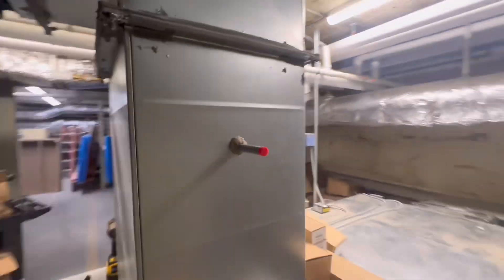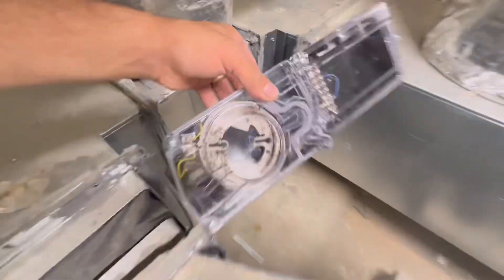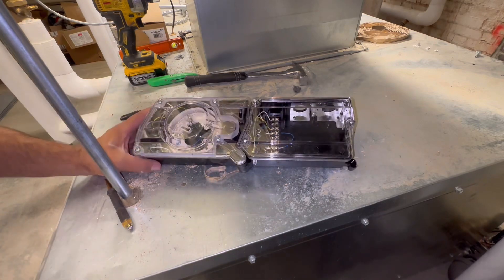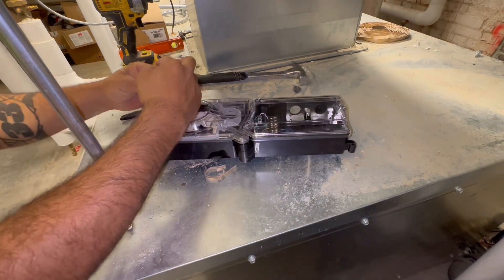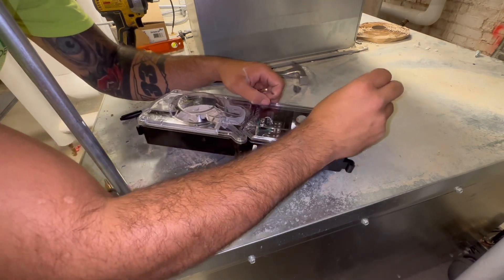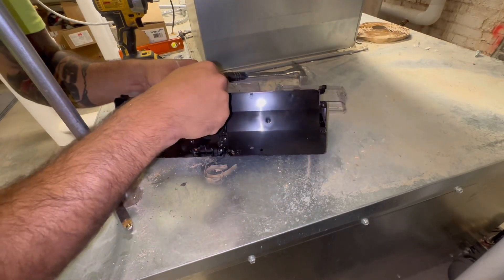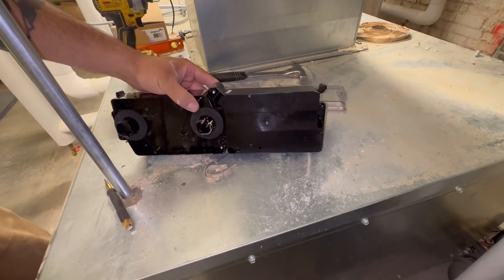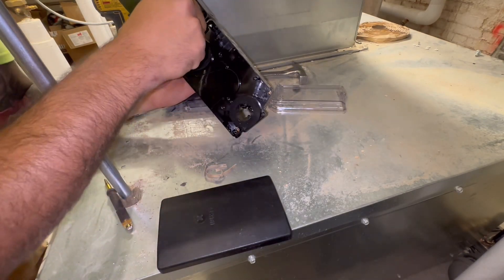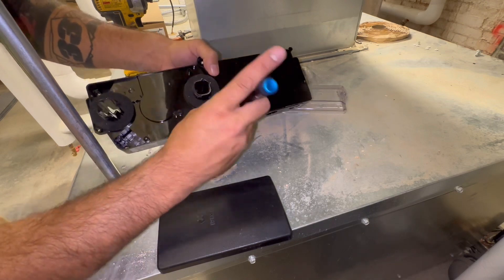Here I'm showing an example on the return side where the housing is too wide and hits the flange. The cool part about these duct smoke sensor housings is they're able to spin around and shorten up a little bit. I pull the covers off, check the screw type — it was a T3, and a flathead works to disassemble it. It's on a hinge system.